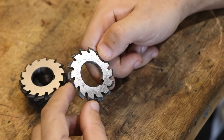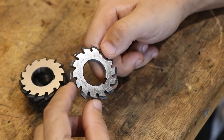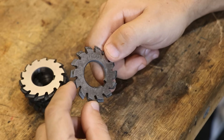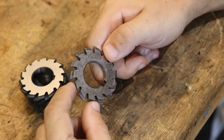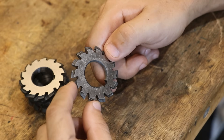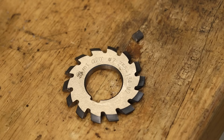How about this for an idea - we can't use the gear cutters to make the gear teeth directly, but what might work is to use those off-the-shelf cutters to make the internal gear tooth cutters. I may need to change it a little bit because internal gear teeth are not a one-to-one reproduction of an external gear tooth, but it may be possible that these external gear tooth cutters could produce a cutter with the approximate profile and necessary clearance to work well enough for basic home shop projects. Even the external gears these cutters make are just an approximation of the perfect involute profile, and people make gears using this method all the time. The number seven cutter is what I'll use, which covers gears with anywhere between 55 and 134 teeth. I'll continue to broach the 100-tooth gear.